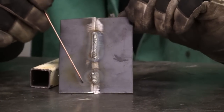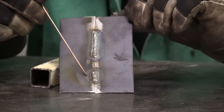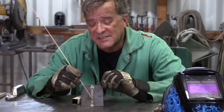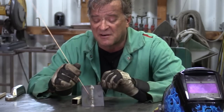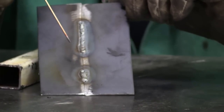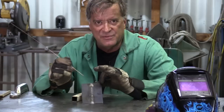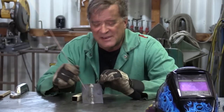With the eighth inch filler rod down here, with the 55 amps set on the Alpha TIG, it takes forever to get that filler rod to melt. And then you start having little problems — I can see it was starting to get a little hot, getting ready to blow through, just because I'm sitting there so long trying to work back and forth and get that filler rod to melt. That's such a huge chunk you're putting right there. But up here with the sixteenth of an inch — I preheated the metal a little bit from welding down here — but it went along a whole lot quicker. You're in one position for less time because you're using a smaller filler rod. It melts quicker so you can be moving along, trying to stay ahead of that heat so you're not overheating where you are.